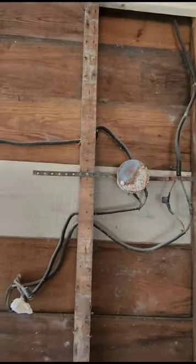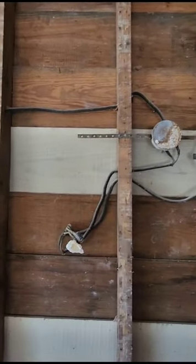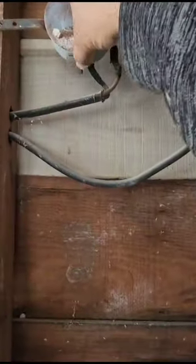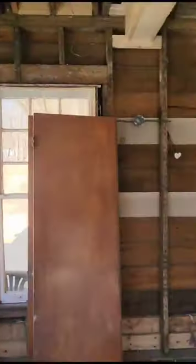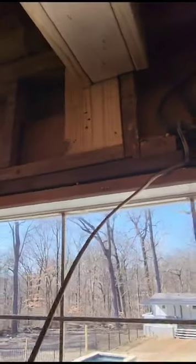This one — there's no use for this. Yeah, there's a junction box — a third junction — we can get rid of this thing, remove all those cables. Here we need to find out where this goes. It's right here — we can run a new cable for that one. And this one we need to fix: we need to put a junction box, we cannot leave this wire like this, and run a new cable line to the outlet.